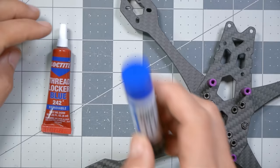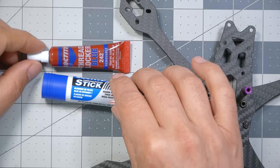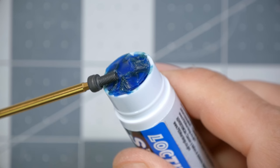If you decide to use Loctite, make sure you're using the blue Loctite — the red is permanent, requires a heat gun to release, and you can't take the screws out again. Blue Loctite is semi-permanent and you can back the screws out, but it keeps them from loosening with vibration. There are two types: the liquid type is a little messier but easy to apply thinly; I like the stick type — just like a glue stick, dab the screw the tiniest bit and put it in.